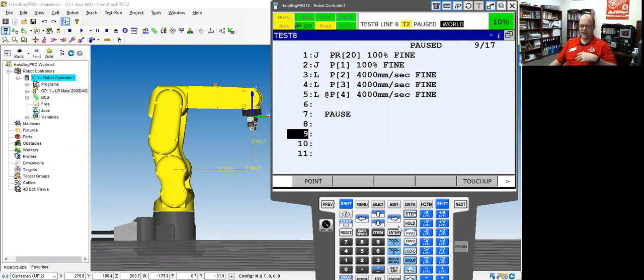Maybe we have a manufacturing environment where that's a weld or something, and we just look at it in space. So we do it here, maybe make that little triangle, but we also need to do it over here, and we also need to do it over here. And as long as we know what frame we're in or what the measurement offsets are, then we don't have to reteach the points because it's all within the same setup.